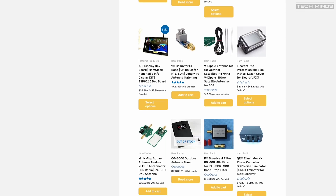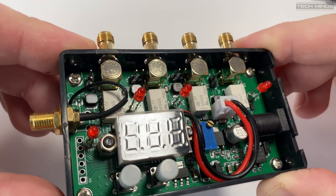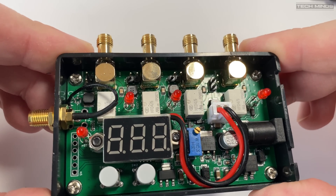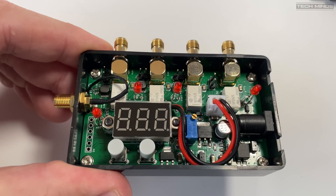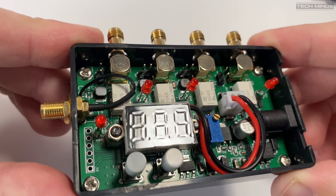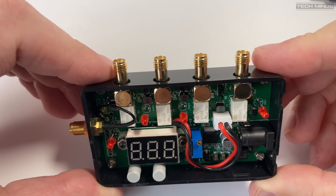Make sure to subscribe to the channel to be notified when that video releases. On insertion loss, it's just 0.7 dB from 300 kHz all the way up to 150 MHz, so it's rather negligible. The DC input voltage must be at least 1.5 V above the set bias T voltage, with a maximum input of 16 V DC. If using bias T on all four ports, the maximum current draw of 700 mA should not be exceeded, so check the current draw of any attached active devices like LNAs or up-converters.